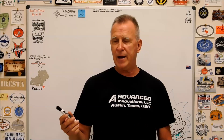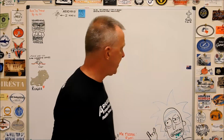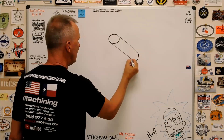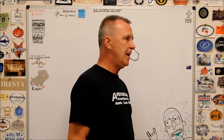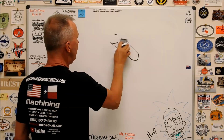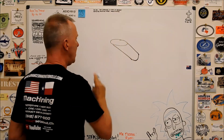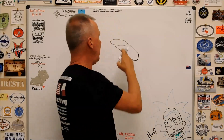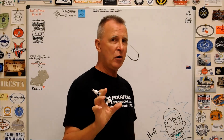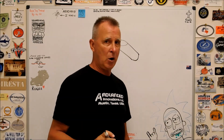The part I got a question about is relatively simple, but things aren't as simple as they appear when you first look at it. We have a cylinder, approximately 3/8ths of an inch in diameter, approximately an inch long. Simple little piece — but somebody went and put a flat on the end of this thing, so now it's an ellipse. Cutting the plane which forms the ellipse is not a big deal, but cutting it to a precision overall length may be challenging, and locating any feature on that face will certainly pose its own set of challenges.